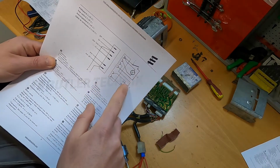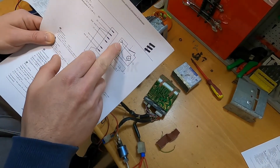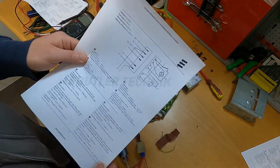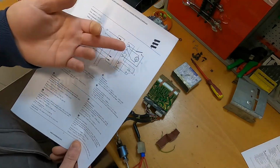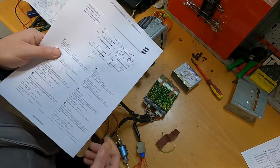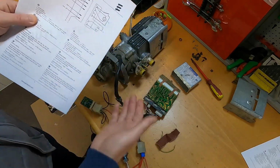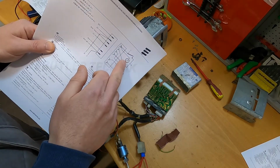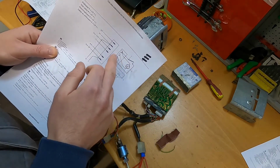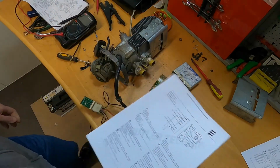and also we can select 2 speeds or 2 heating capacities, and we should get some diagnostics if we connect a bulb onto this and these 2 wires. But from my side I did that, but nothing happens. So when I switch on the unit, the bulb will light up, but after it stops, the light just goes on continuously because it has positive from this wire. So if I disconnect it, the light just goes out and doesn't give me error codes or nothing like that.